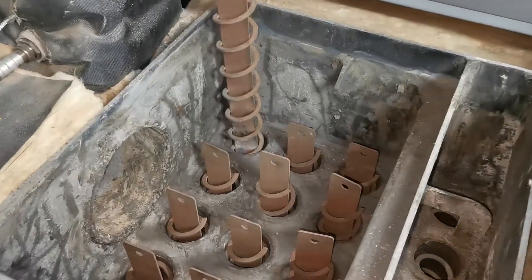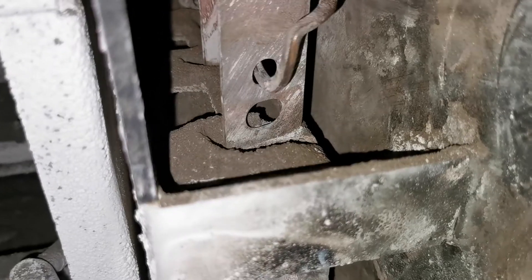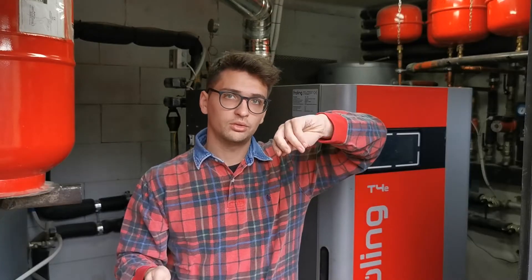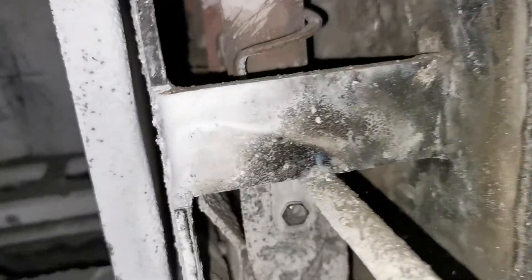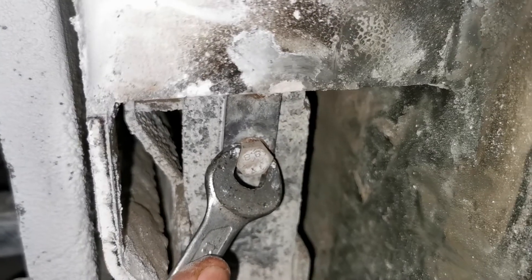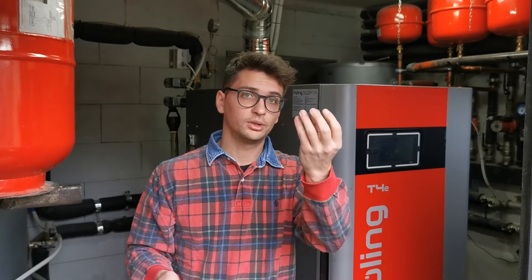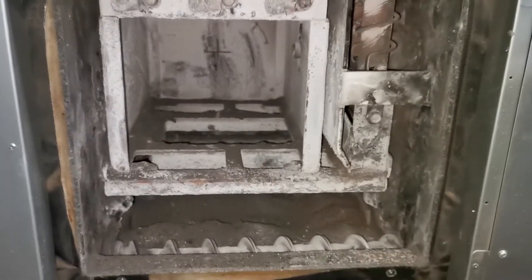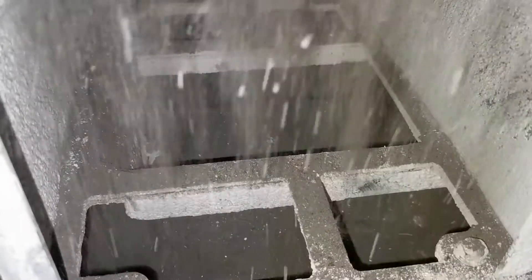You can then proceed by reinserting everything: 15 tubulators in the slow-air section and 5 tubulators in the fast-air section. Remember that when remounting, you have to align the internal strip with a specific slot in the mounting frame — you may need to turn the tubulator slightly for it to fall into the slot correctly. Once done, re-lock them by inserting the pin. The auto-cleaning procedure at boiler startup has the moving frame slowly rise and then fall rapidly, so tubulators are shocked and ashes fall down.